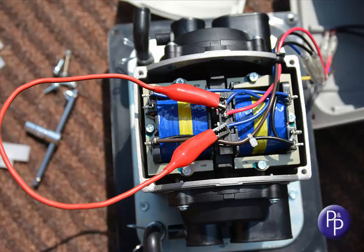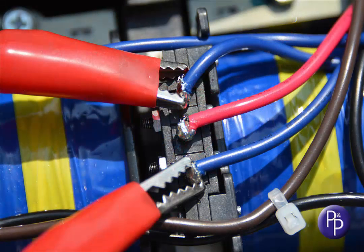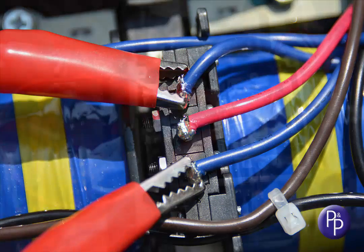If you don't have a meter to check the continuity through the switch, and you've fiddled with the switch until you're losing the will to live without any success, you might want to cobble together a piece of wiring, perhaps similar to what we've got here, to bypass the autostopper switch entirely. If, when powered up, the pump then starts, it's quite likely that that switch does need replacing.